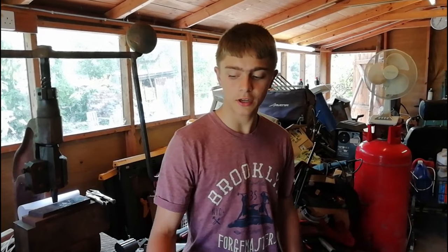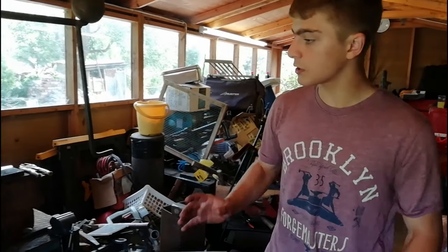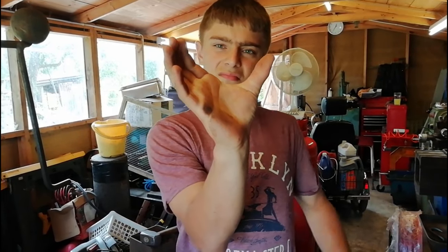I've got a piece of metal and I'm just going to stick it in the forge - we're going to heat up the forge in a minute. The fire bricks help trap the heat in. What we are going to be making today is a big hook, about this size at the bottom, goes around like that, hangs off the wall. Basically just a really large hook with a little leaf decoration on the end of it, on the top of the part where you're drilling into. It's a pretty simple design and I've decided we're going to use this metal for a quite nice pattern.